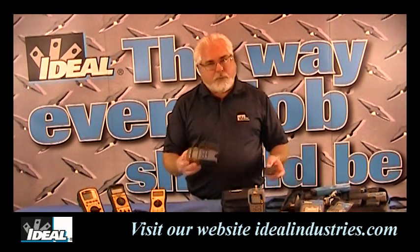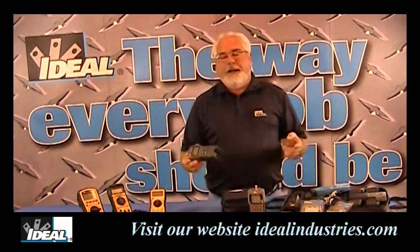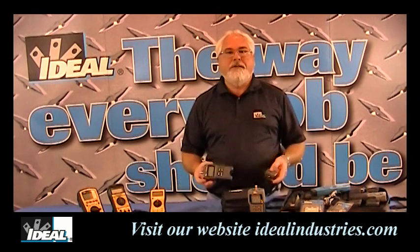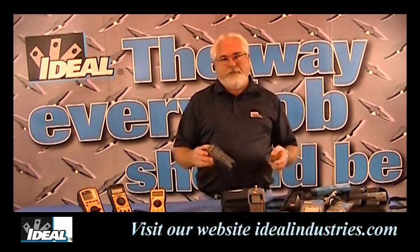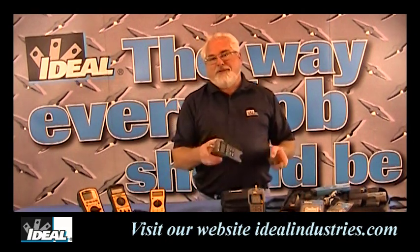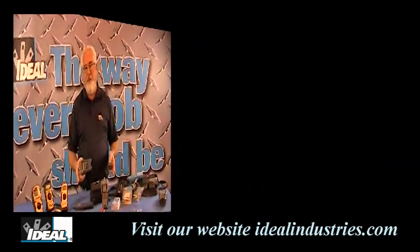This tester will do all of the basic tests you're looking for a tester to do. In coax, it's going to look for opens and shorts. It will also look for USOC wiring in phone circuits. And in data networking, it'll look for 568A or 568B wiring schemes and look for opens, shorts, miswires, reversals, and split pairs as well. The tester also does length and blinks a hub, so it's a great little tester. So let's take a close-up view, and I'll step you through how to use it.